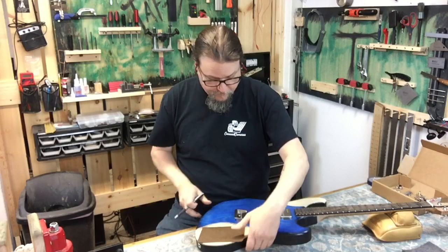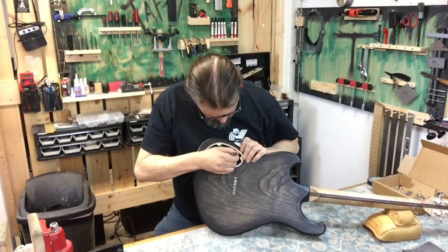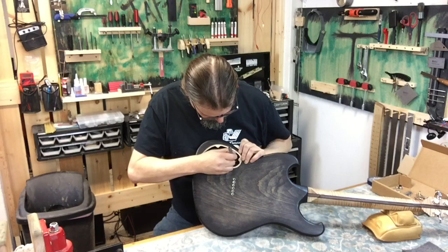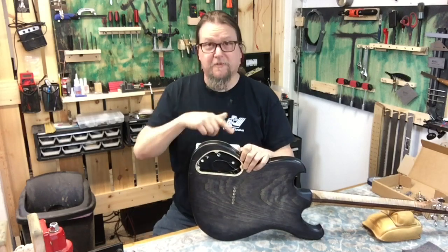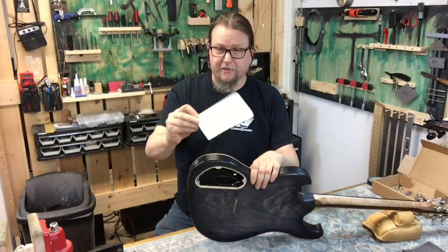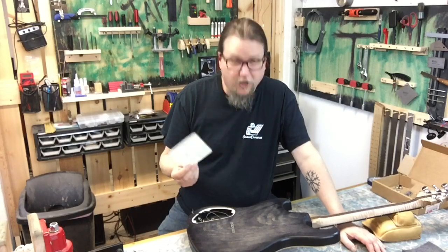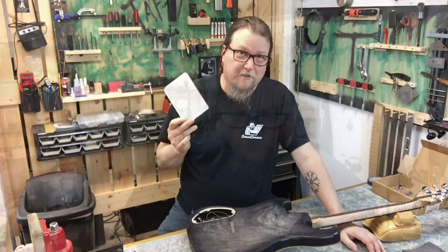Here, why don't I show you? Sometimes that's easier. So there's my volume, there's my tone, there's my switch. I might even mark it. Volume, tone, switch. It's a V. That's all you need. And then, boom, there it is. I'll go over, I'll drill these out, and there it is. I can do most of my wiring, get it all put together without ever stuffing the soldering iron into the control cavity.